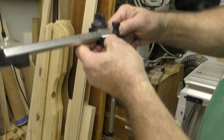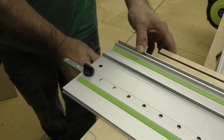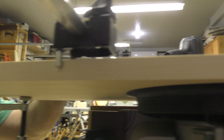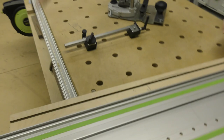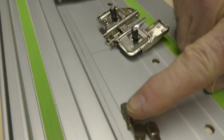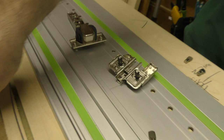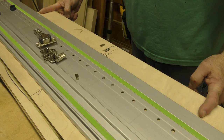Set the parallel stop at 37, take the pins and put them right up against there, lock it in underneath — and always check your pin for daylight, because you don't want it to move. Lock her in, ready to go. Remove the pins, label the rail. These are shelf pins for adjustable shelves — they're 5 millimeter, which is why you chuck up a 5 millimeter bit. We could do holes from top to bottom, but that sometimes doesn't look good on certain species, so we're going to put about six holes in the middle for our shelf pin holes.